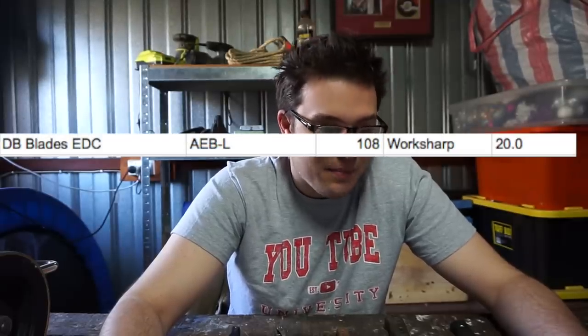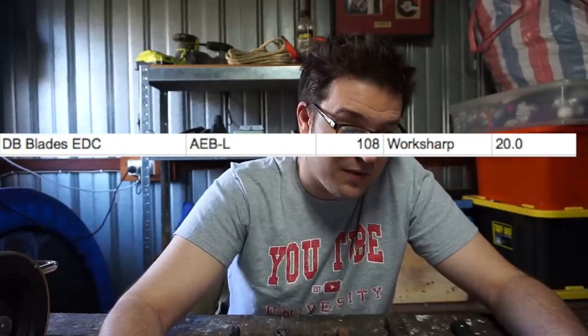Absolutely. AEBL, I tested a DB Blades AEBL knife. This is good stuff. It actually reminds me a little bit of RWL 34, just in how it acts and performs. It's sort of a slightly higher than average stainless steel, but still popular with custom makers, obviously because it's available and easy to machine and all that sort of good stuff. So AEBL, haven't tested it extensively though, so probably limited stock in what I can share about it, but certainly made a good first impression. And that's really all I've had from AEBL so far.